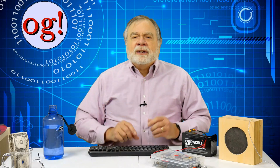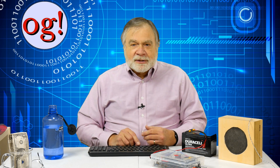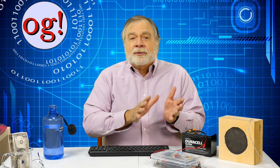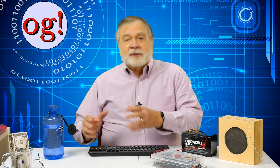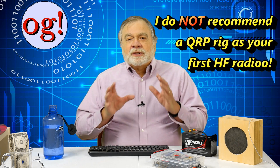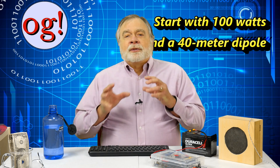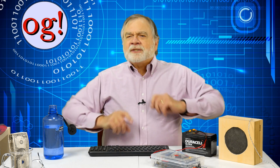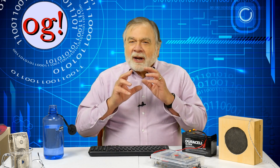QRP can get through well when the band conditions are right, and 40 meters is the right band at this point in the sunspot cycle. As far as signal reports I've been given, I've heard that the radio doesn't let any carrier leak through, but another station told me I did have a bit of carrier, meaning the balanced modulator wasn't balanced. I've been told that my audio is great, and I've been told it's raspy. These issues address why I decidedly do not recommend QRP as your first radio. Start out with 100 watts and a 40 meter dipole, and build your operating skills from there.